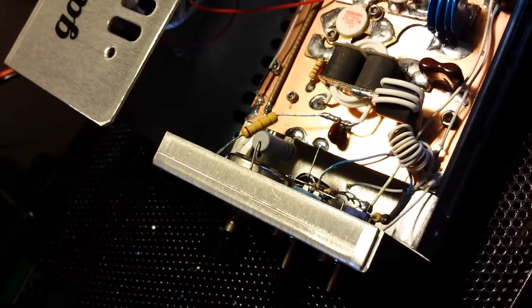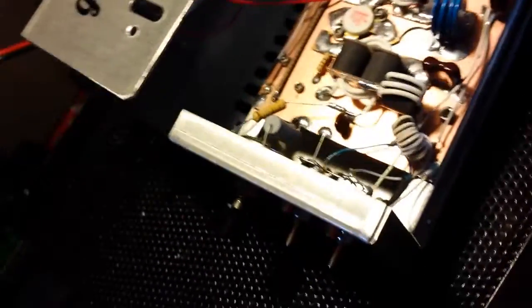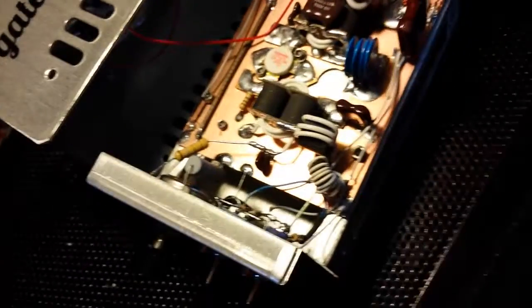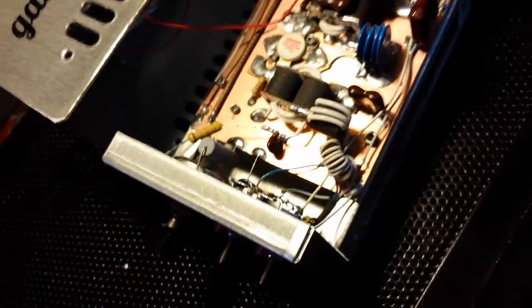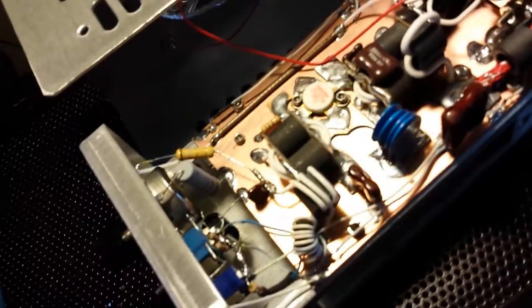Most of the time the variable will still work when that thing is blown. Sometimes they'll throw issues. It's also blocking any DC remnants of signal mixed in with the AC as well — so it's doing two things. It's always just like, you use a 5 watt, man. Ain't nothing wrong with throwing in 60 more cents and using a 5 watt.